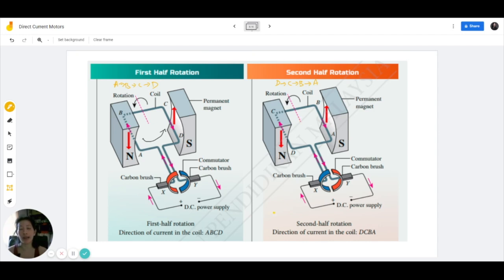So one thing I get asked a lot is why do we need a commutator that's split into two halves? Why can't we just use a complete circle as a commutator? It is a good question and I encourage you to think about it. Let me show you one of the reasons. So when you place a commutator that's a full circle, you're going to create a short circuit. When the current flows, instead of flowing through the coil, it's going to flow through the path of zero resistance.